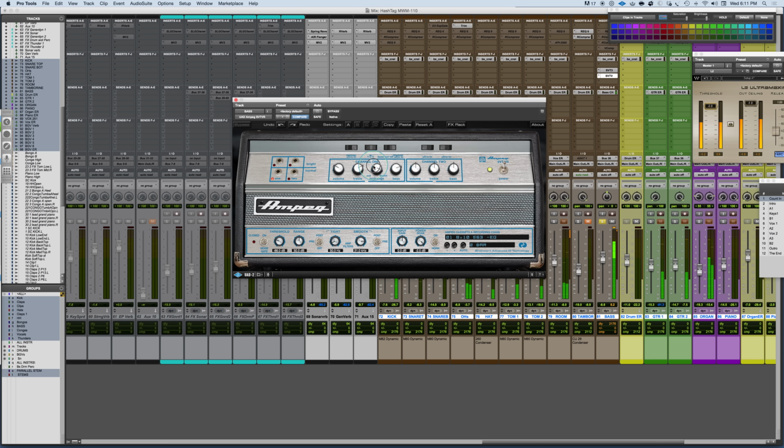You also have a nice tone control that gives you a low mid, more of a drive characteristic. An 800, which is a really great way of focusing a bass on smaller speakers to get it to stand out. Or a nice, really bright presence up in the 3K range. And that 220 setting is a real power setting, really great for a driving kind of bass. So just that alone gives you some really cool controls.